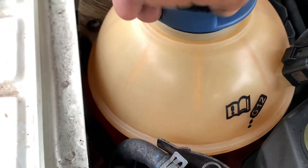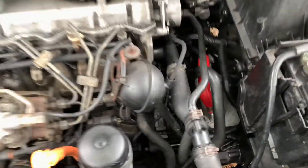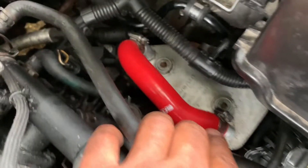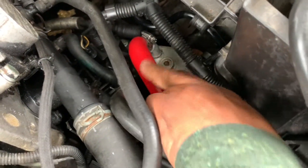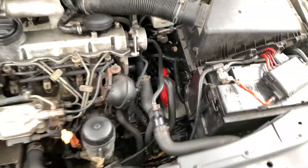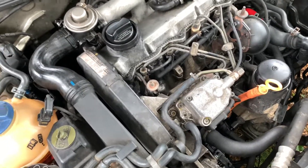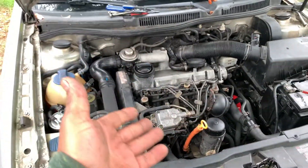This car was the one with oil in the cooling system — we already cleaned that. I bypassed the oil cooler like this so it doesn't mix the oil with the coolant. Right now it's just like this — it's not the transmission; this part right here was the bad one. Now the system is clean — no more oil on the coolant. That's a tip for you guys — stay tuned because we're still making more content for this car.